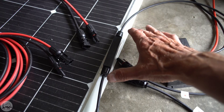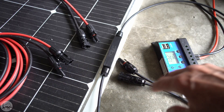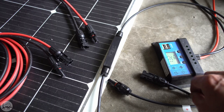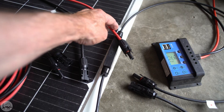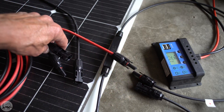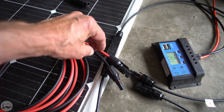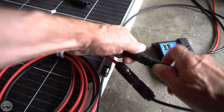When you buy your solar panel, the cables coming out will tell you what's positive and negative. These aren't color coded, but they do have little tags showing positive and negative. These are MC4 clips — waterproof connectors. When you buy your extension with MC4 clips, just make sure the colors match your positive and negative. For example, this red one is positive but it's a male connector, and the positive coming out of the solar panel is also male — so that's not going to work. Same goes for negative. Just watch it when you buy extensions. Here's a female positive and a male negative — that's going to work. They're weather sealed and just snap in.